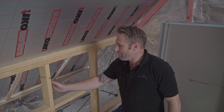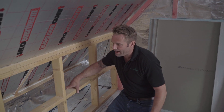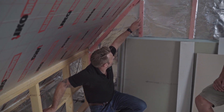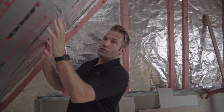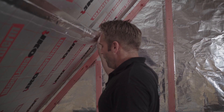So this is now going to be a pain. Obviously we've also got to put the service batten — this won't necessarily need service batten but you can see the gable wall here that's already got it on. So this is the VCL again compressed to the wall — it'll be lapped and taped. We've also taped the actual joints on here. The actual insulation aids the air tightness as well. As you can see throughout, this all helps.